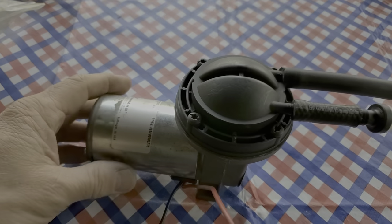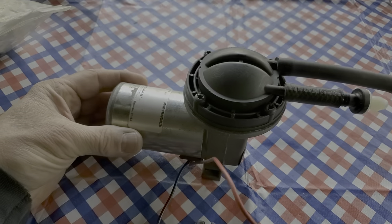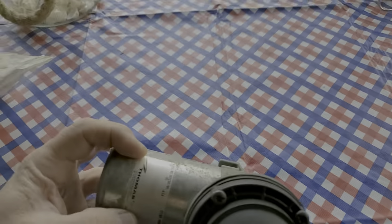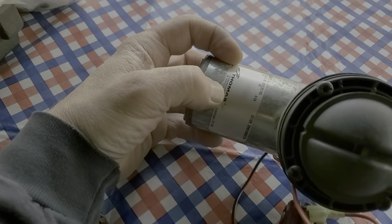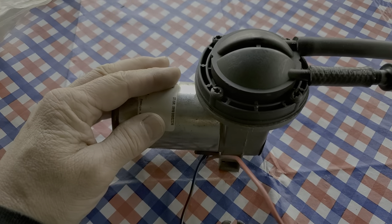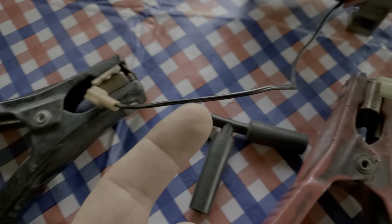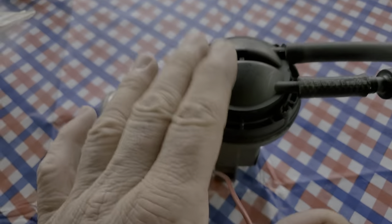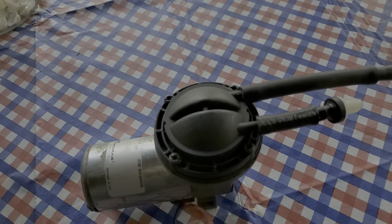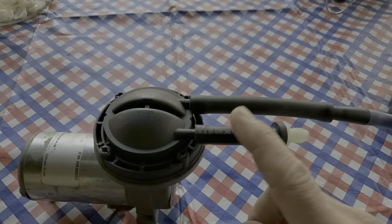What we have here is an air pump motor supposed to pump five to six PSI. It's out of a Hurricane heating system, but it's a Thomas. You can find these from $259 to $450 some dollars. It's just got a red lead which is positive, negative. The control board makes this pump, and this goes to your fuel nozzle assembly and a zero pressure regulator, which we'll get into later.